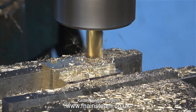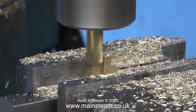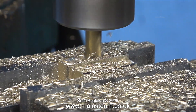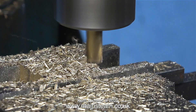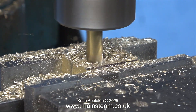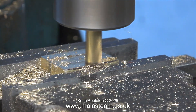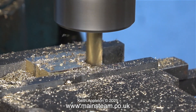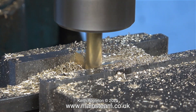The good thing about brass is you can take quite deep cuts and it cuts beautifully. But what you have to remember is these chippings coming off the brass are razor sharp. Do not, under any circumstances, touch them with your fingers. Eye protection is fairly essential — you certainly don't want this stuff in your eyes. It's really health and safety common sense. Getting the job done successfully without damaging yourself is possibly a better idea.